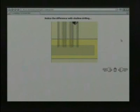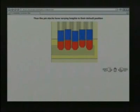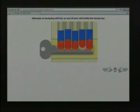You just drill, and let's drill this one a little bit, not so deep. Then, when you load your pin stacks into the lock, one of them will not protrude all the way down. Now, a regular key can go in this lock. A regular key can lift this to the right height, but a bump key will not hit all the pins. You can bump on this till you're blue in the face. It's not going to kick them all up.